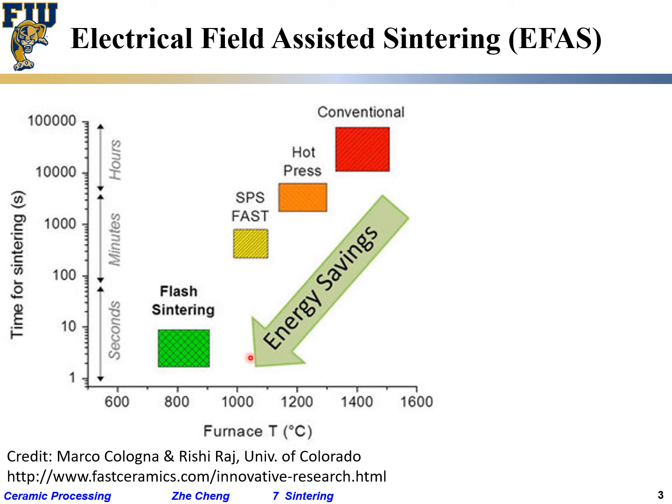And then finally, flash sintering. We are talking about ambient temperature, the surrounding temperature is 800, 900. And the sintering time, we are talking about, wow, 3 seconds, 10 seconds. So you see, these are different so-called sintering paradigms or regimes, different techniques. And of course, in terms of instrument simplicity, this one is simplest. But in terms of energy efficiency, this is probably pretty low. This one is probably pretty high.